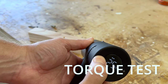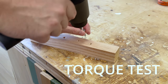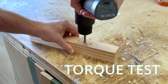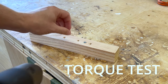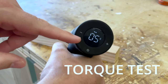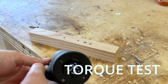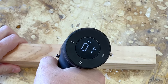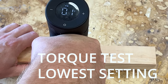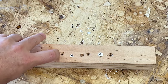Let's change the torque setting down to five and see what happens. It stopped once it felt the pressure, and this light blinked. So when it hit five and I drove the screw, it blinked and stopped — pretty much flush once it got that torque. Now we're set to one — and it stops and you can see it blinking right there once it hits, and that screw is set.